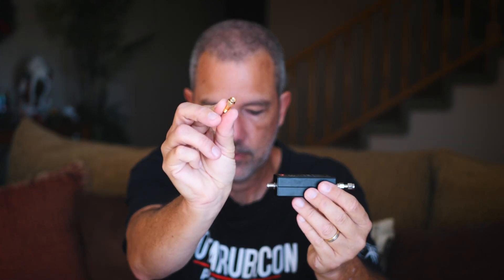It's really easy to use. I've had several old CB SWR meters that were kind of hard to use — you had to flip a button, adjust the needle, flip it the other way, then transmit. This is way simpler than that. You can measure power up to 100 watts, though you should use a dummy load when measuring power output. When you buy this it comes with a little 5-watt dummy load, which is only good for up to 5 watts — so if you want to measure power output on a higher-power mobile radio, you'll need a better dummy load. It also comes with some common SMA-type connectors, though depending on your setup you might need to buy an additional adapter.